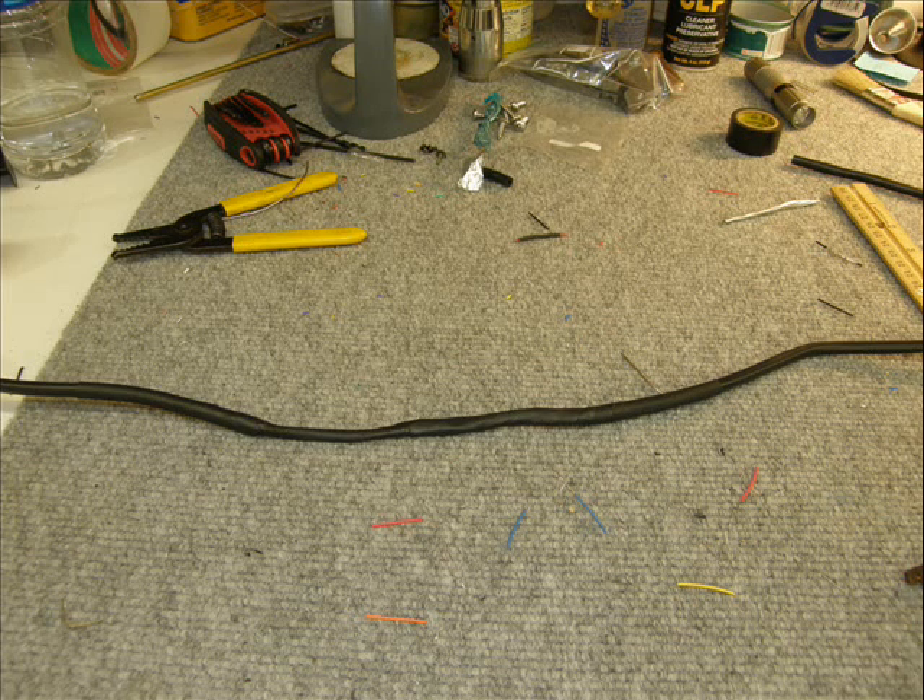One thing additionally I'd like to point out is these splices are not going to be as strong as the original wire. Most wires include some kind of a strain relief device like string. In this particular case, the wire had a very thick outer sheath which was pretty tough. Now we're depending on simply the heat shrink and those soldered connections. So make sure that when you put that wire in, all the pulling is done before you splice the wire — you don't want to pull on these splices. They're electrically connected but not very good mechanically. I hope this has been helpful and thanks for watching.